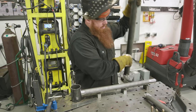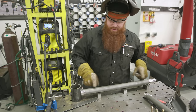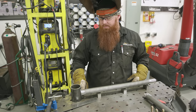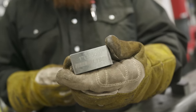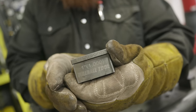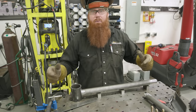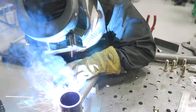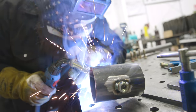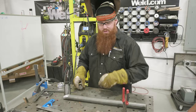We have the base plate down to our vertical post - that's taken care of. Now I'm going to weld the horizontal member. I have a four-inch tall piece of pipe and this is inch and a quarter, so I have an inch and a quarter from the top of the pipe to the top of the tube, and the same at the bottom. We used the magnetic shims from Fireball - put a one-inch shim together with a quarter-inch shim for an inch and a quarter shim - three of those to line this up exactly where it needs to be, get a couple tacks on it, and then weld it out.